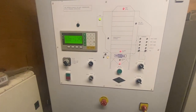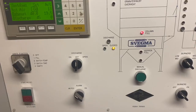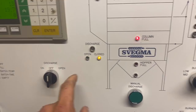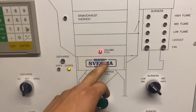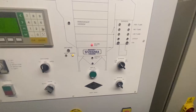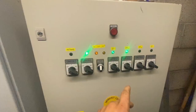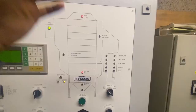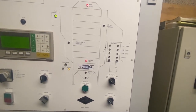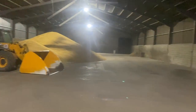So it's switched now onto drying - time to shut it down. What I do is discharge off - lets this hopper empty completely and recycle to the top so it's not getting discharged back into this hopper. Then I'll turn off the bottom conveyor which is the conveyor that takes it to the elevator which takes it up. I'll give that a second and then turn off the elevator, then turn off the top conveyor as well. Then it's ready to be completely shut down with the big red button. Silence. Time for bed.